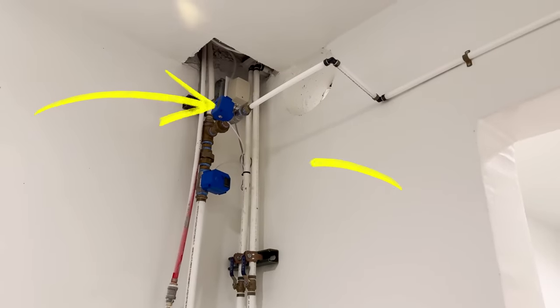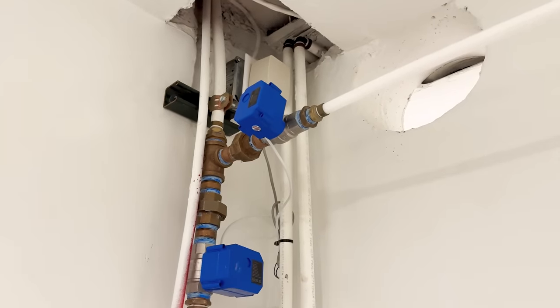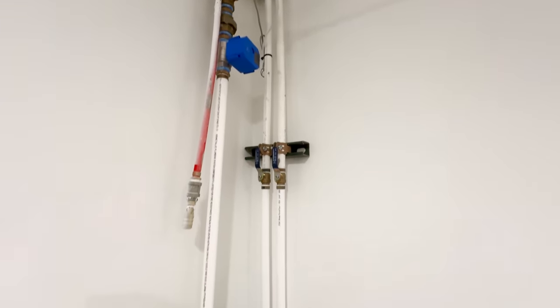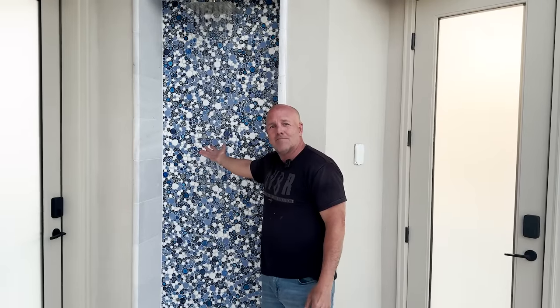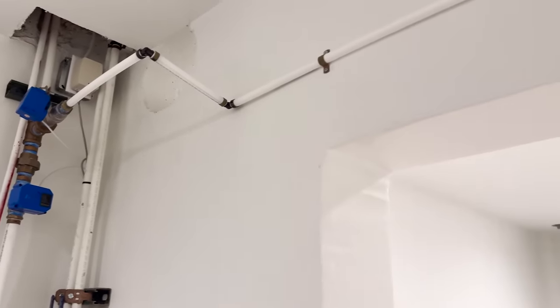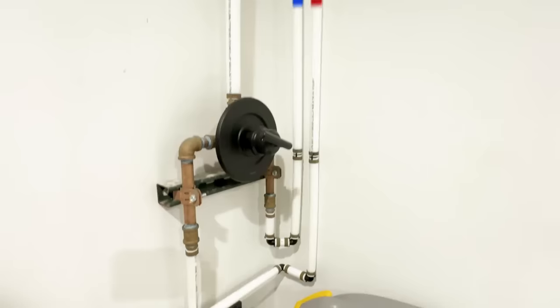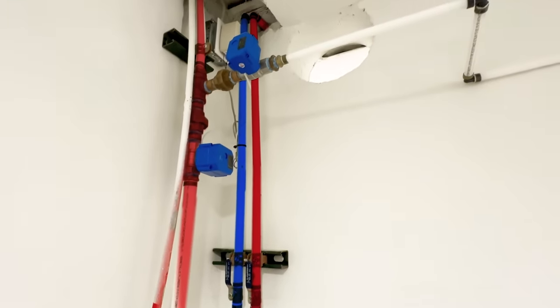And three stories down, there are two valves. One's normally open, one's normally closed. As soon as I hit that button, it's slowly turning two valves. One valve opens up the water that feeds to the top, going through a mixing station so that this is already hot at the perfect shower temperature every time. You don't touch anything. But the other valve is actually closing off where this will eventually drain. For example, right now it's operating, one valve's open, flowing through a predetermined temperature, flowing up three stories in the house from the very basement, coming over the top.